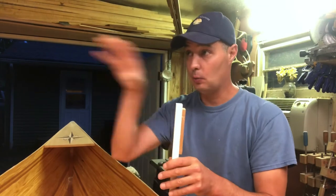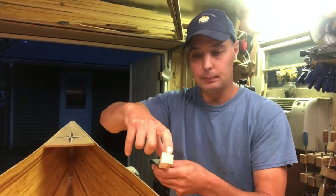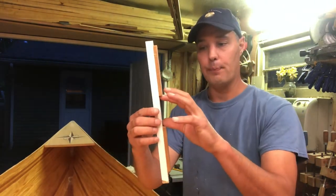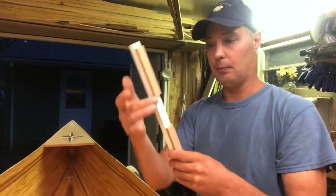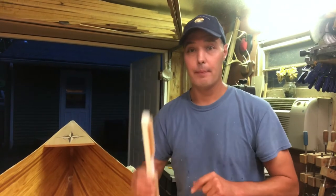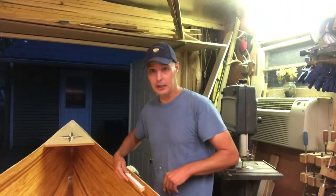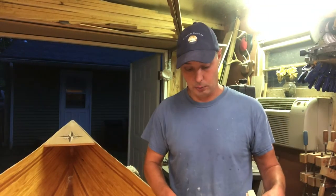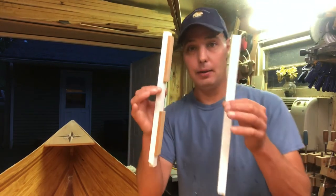I made these four inches because that's what my yoke going across is — four inches — and I wanted it to be even with it. I don't want to see gaps or anything, so I went four inches, skip four inches, another four inches. This one's just a mock-up so it's not exactly four inches. The reason for the open gunnel is that when you get water in your boat and flip it over, the water will come out, as opposed to if it was just a solid piece of three-quarter.